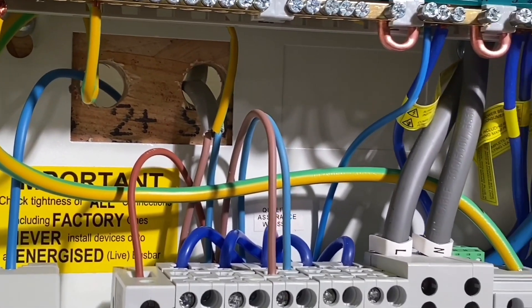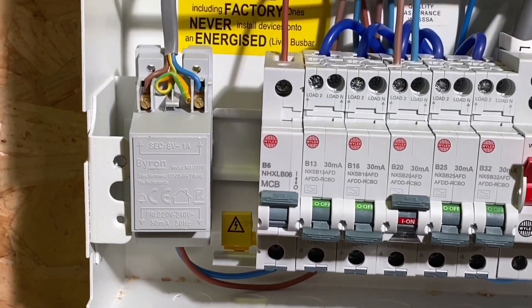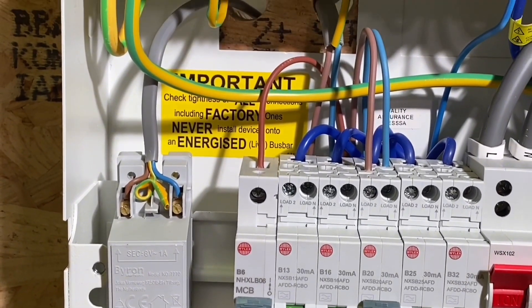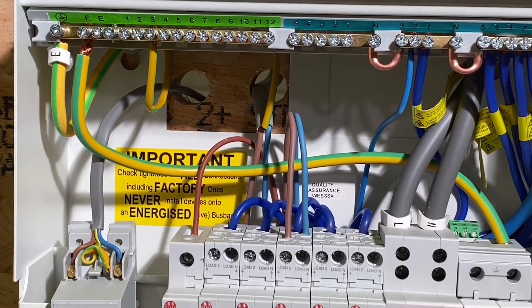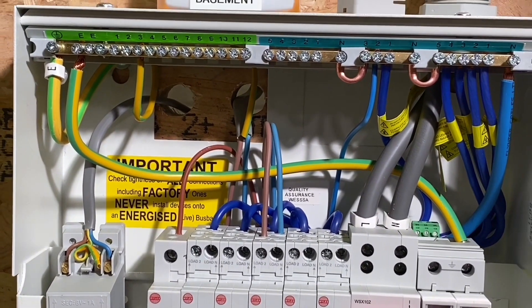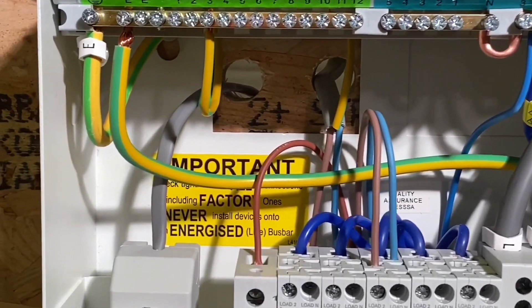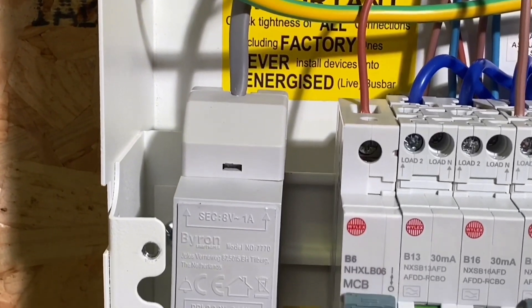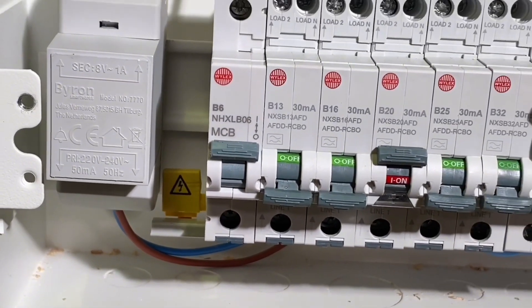When we returned to that installation to change the board and tidy the routing, one of my favourite solutions is to just use mains-rated cable - I've used 1mm twin CPC here, or twin and earth as it's known in the real world. That looks good, though you might struggle at the other end where you bring it into the chime itself, as those terminals tend to be very small, as do the cable entries.